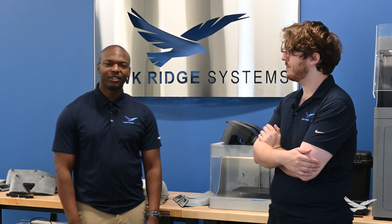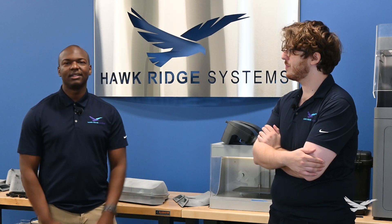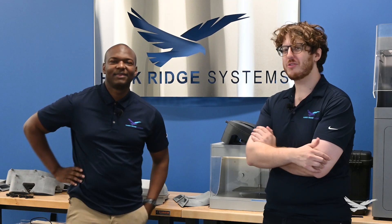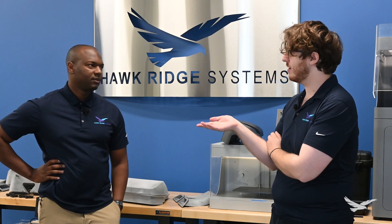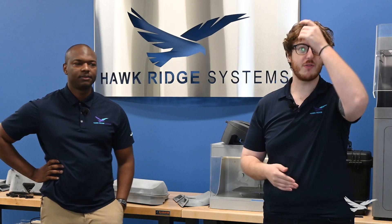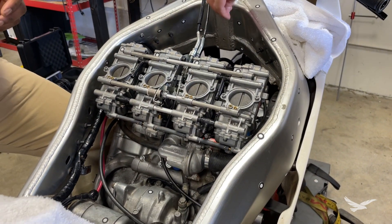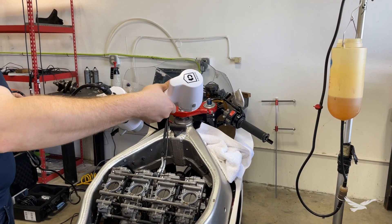That's when I talked to Matt and asked if I could borrow a scanner to scan the motorcycle frame and get reference data so I could design an airbox that actually fits. We sent down the HandyScan 700, which is a red light laser scanner from Creaform — a handheld scanner with a laser tracking system, very high resolution and accuracy. The targets placed inside the bike maintain that accuracy, so you don't have to worry about misalignments. It took about five minutes to capture the scan data, even including putting the targets on — quick and easy.